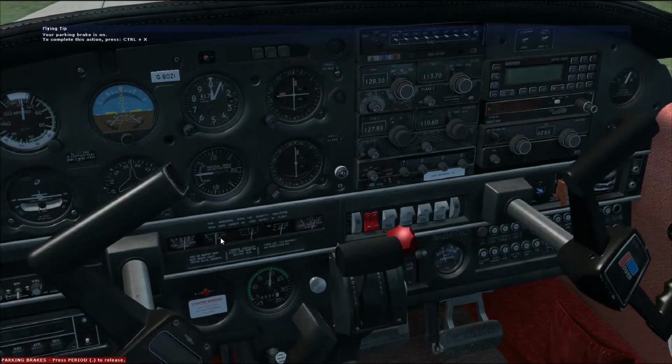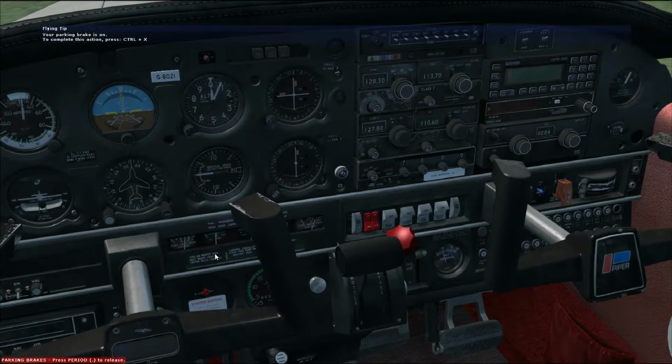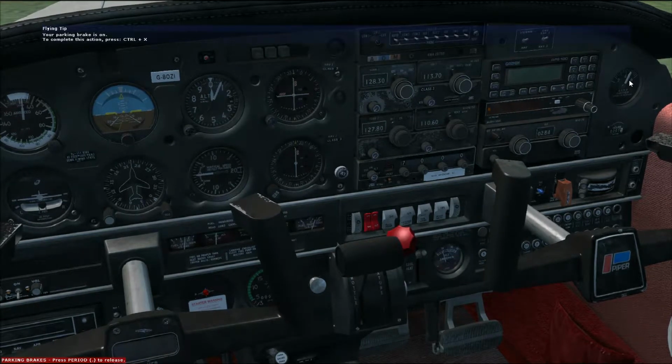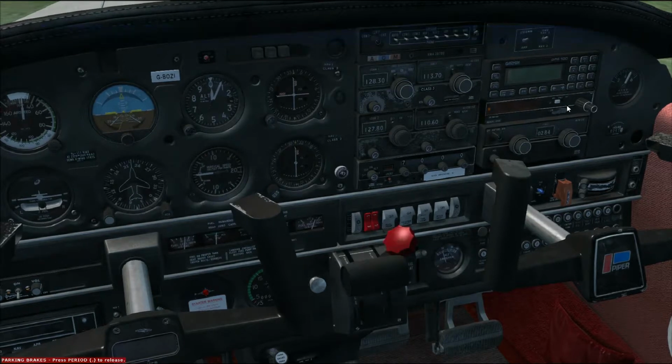Temps and pressures all in the green. Yep. Suction 5 inches mercury plus or minus an inch. Yeah, I'm assuming so, that's over there. Yep. Slow running, lower the RPM to 600 to 800 RPM.